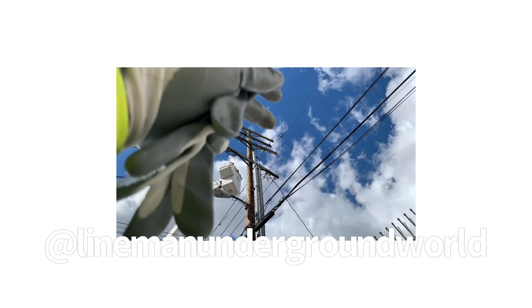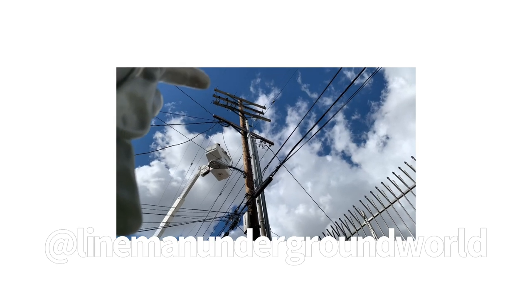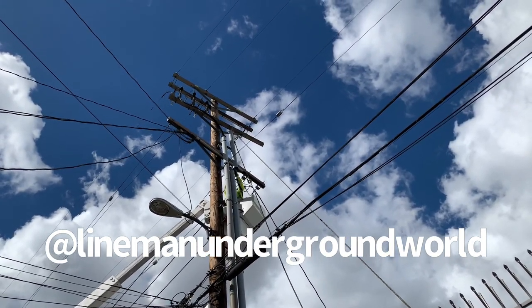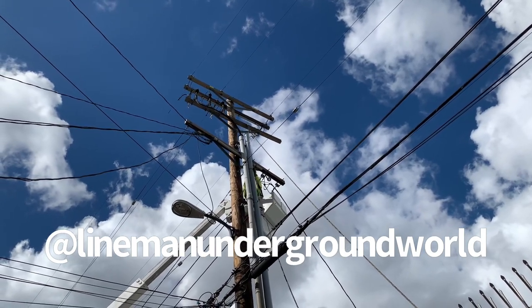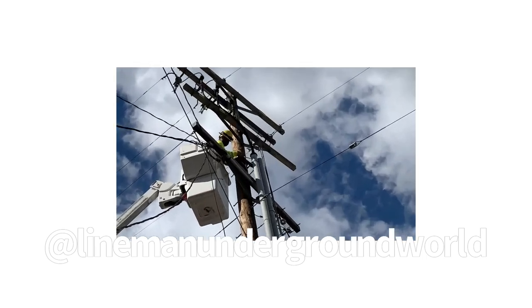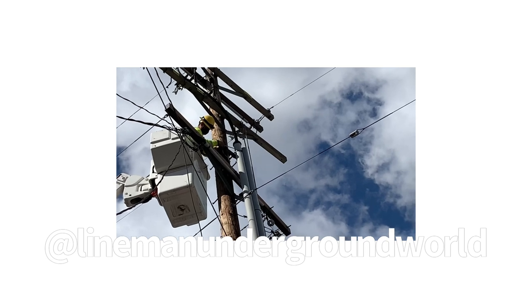So what he did is he pushed the unistrut on the very top one over so he could have enough space to land the other riser now. Alright, stand by. Last thing going up, and gonna push our fish tape through it. And once it's all through, he lands it and puts the strap on it. Alrighty. It looks good. Setting it. Then he'll put a strap on there, we're good. Now that he cut the string off, he's tied to the unistrut or the V-brace or something up there, and he's good until we come back with the cable and pull it in.